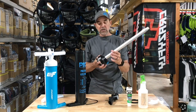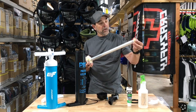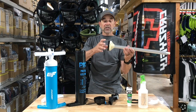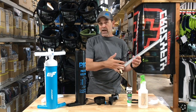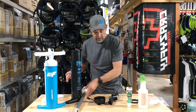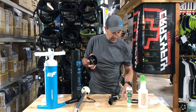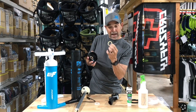So what you want to do is get all this cleaned off. Once you remove the top part, this is the one part where I've taken the two screws out — this usually stays up inside of there. You want to clean all the shaft off here, get all this nice and clean, get all the sand out of here, scrape it down. Using alcohol is perfect. Clean out the inside of your tube. Then you want to get up inside of here and remove the two Phillips head screws. That seal is right up here — notice its direction. You want that opening on the bottom, or the smooth part goes up, the opening is down here.